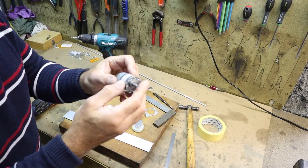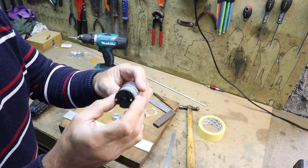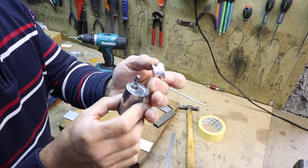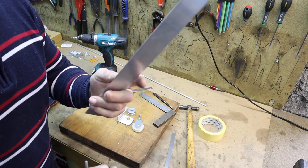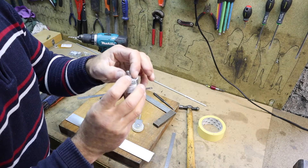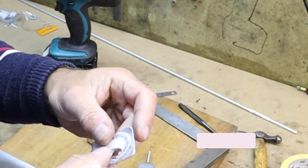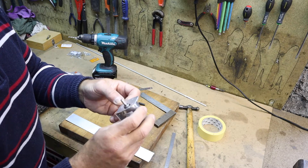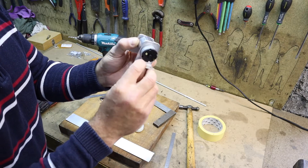Here is the motor — it's a small 12-volt, 7 RPM unit, only about 12 euros from Amazon. All the links to parts for this project are in the description below. I also bought a small pulley with it, which fits on and screws in with the allen key. I had to make a little bracket out of a strip of aluminium — drilled a few holes using a paper template, center-punched and drilled them out with a step drill. Then I made a second bracket to go on the back.